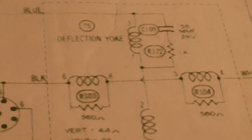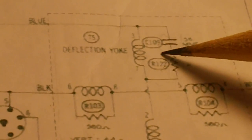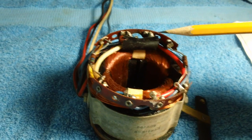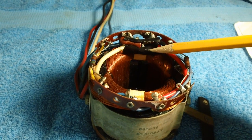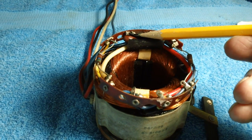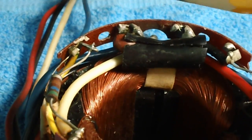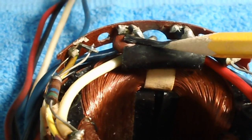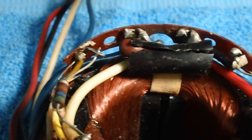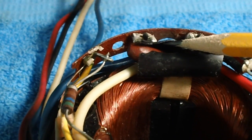Since the old tubes test good, we all know what that means. We're going to have to go to the yoke here and test this. I know the resistor is good. We're going to have to test this capacitor right here. The old yoke is out of the TV, and the capacitor and resistor that I showed you is inside this black thing right here. I cut it previously to test the resistor, and I really had no way of testing the capacitor, so I left it. But this time we're going to go ahead and unsolder it here and there, and take the entire thing out.